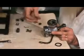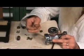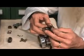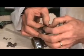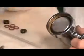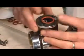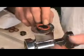So what we've done, this is 700 degree Fahrenheit rated silicone. And a really nice thing is that it doesn't bake flat, and you can use it over and over again. You can take the group off and put it back on repeatedly if you need to maintain the group or to get in and pull the piston out. It's a lot easier to do with the group off of the machine. So this basically has infinite reusability as far as I know.